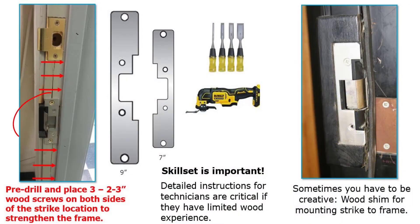Working with wood — I had a customer that had wood frames we had to work with, and I got pictures from other applications I'd seen over time and shared them with my technician. Here's an application where they added in an electric strike. We often put so much pressure on technicians to go faster, and by doing that they use power tools and power everything in. But if they don't know and understand what they're working with, they're going to create problems — you can see they put their screws in and cracked the wood. Old, dry wood requires knowing how to work with it and having the proper tools.